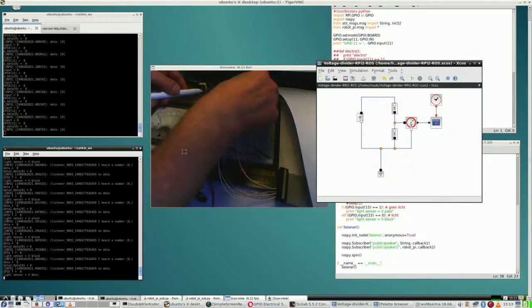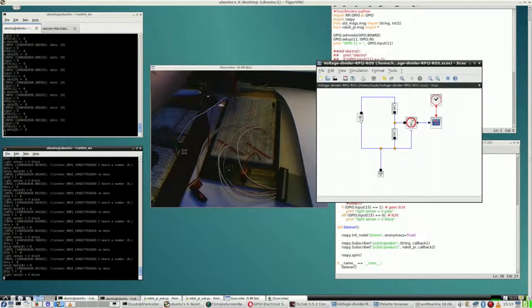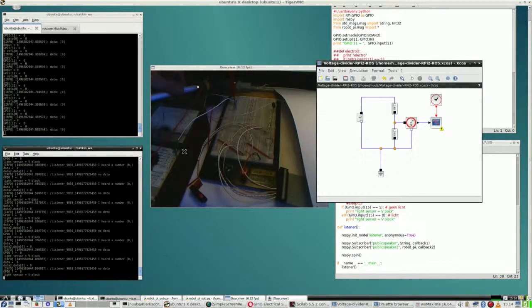So I'm going to measure now. I hope not to block your view. Right here. It's 4.5 volts. So I shine straight into, this is better, I shine straight into the transistor, and it has actually totally no effect. And last time, which is 2 weeks ago or something, it absolutely did have effect. So the question is, what is the difference? Why doesn't it respond now?